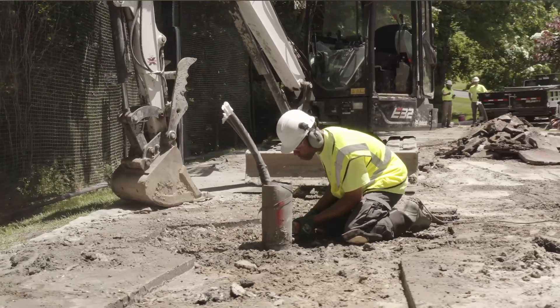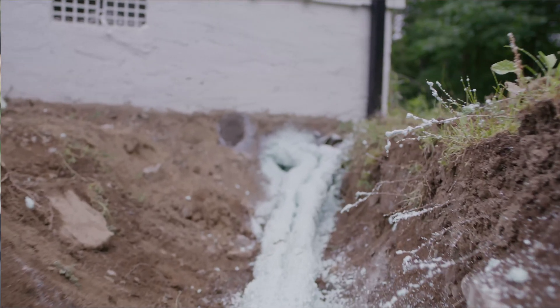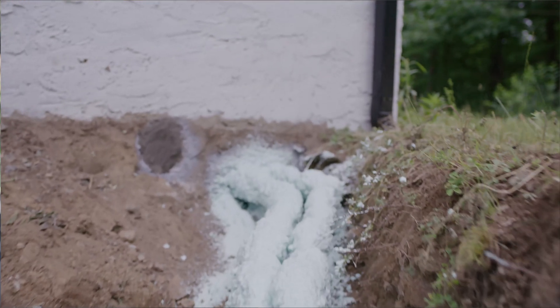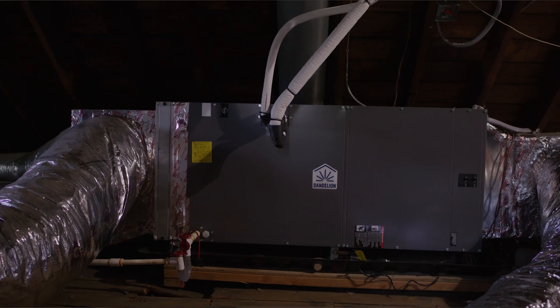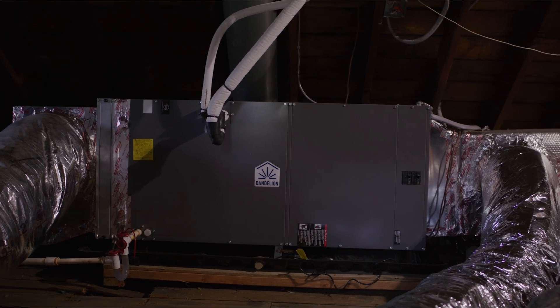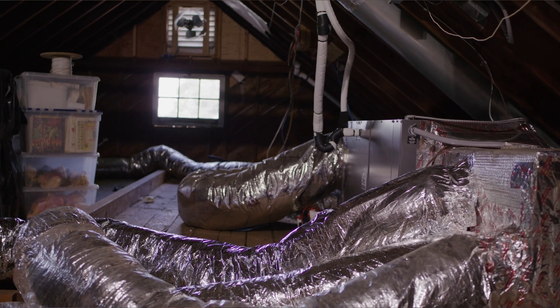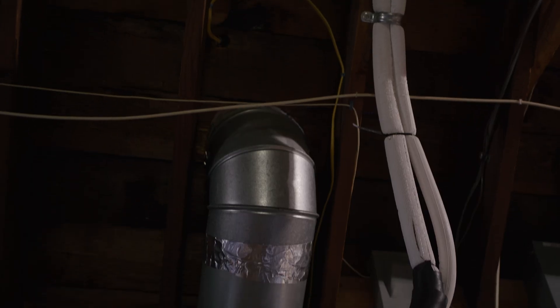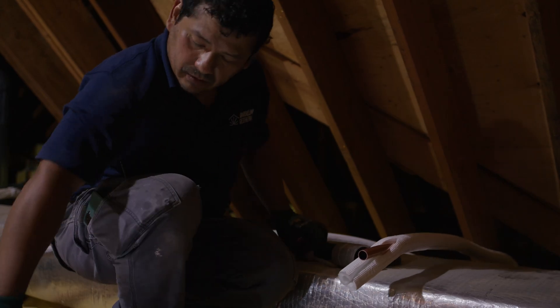There are three of them. First, there's the ground loop that can go as deep as 500 feet into the ground. This is filled with water mixed with a small amount of earth-friendly antifreeze. Second, there's a geothermal heat pump that replaces your furnace and your air conditioner. This heat pump typically goes in the basement, but it might go in your attic, or in some houses it goes in both places depending on the setup of the house. Lastly, the system uses ductwork to deliver the heated or cooled air throughout the home. We typically use the ductwork that's already in the house, but some homeowners do need to add ductwork when they get their system installed.